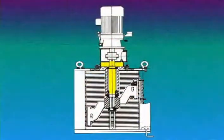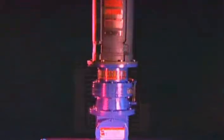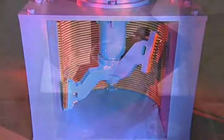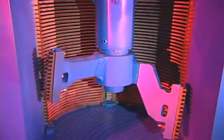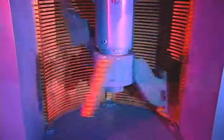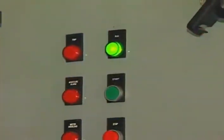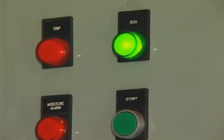That's what is the heart of the ease of maintenance. With the Diminuter, you get the best of both worlds. We chose the Diminuter primarily because of its 360-degree rotating ability. We formerly had an oscillating design, and when that would get stuck or something jammed in it, it did not have the ability to free itself. With the Diminuter, if something's in there, it will stop, it will reverse, and whatever is jammed in the unit will basically be freed and chopped up. With the Diminuter and its S250 controller, reversals are nearly instantaneous.